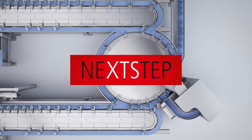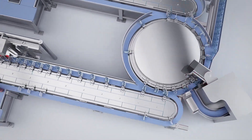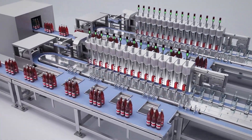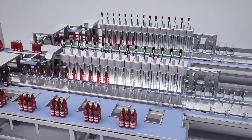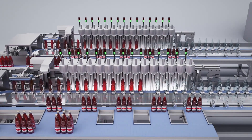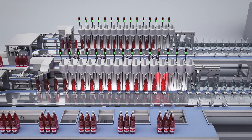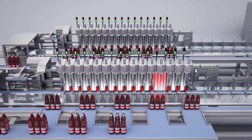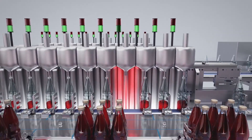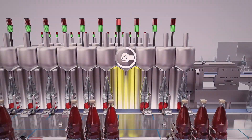It also gives you a lot of flexibility in many machine designs. Where on a rotary table everything is indexing at the same time and synchronized, the XTS gives you flexible asynchronous motion. One group of movers can be doing one thing, another group of movers can be doing another. When you start designing your machine around the XTS, there are lots of benefits that allow you to rethink your machine designs and utilize the benefits of the XTS.